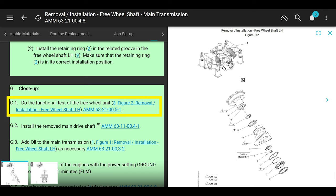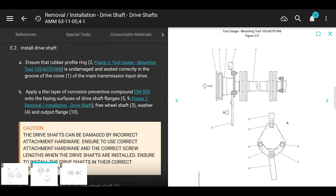So now we go back to where it says install the freewheeling shaft. Do a functional test of the freewheeling unit. If you go to that chapter, it says if you turn it one way, it's supposed to engage. If you turn it the other way, it's not supposed to engage. It's actually pretty simple. Make sure that you functionally test the freewheeling unit. Not complicated. Next, install the removed main drive shaft, and that's where we're going to go now. But we have to come back to this chapter because there's about 3 or 4 more things we still have to do. So install the drive shaft,